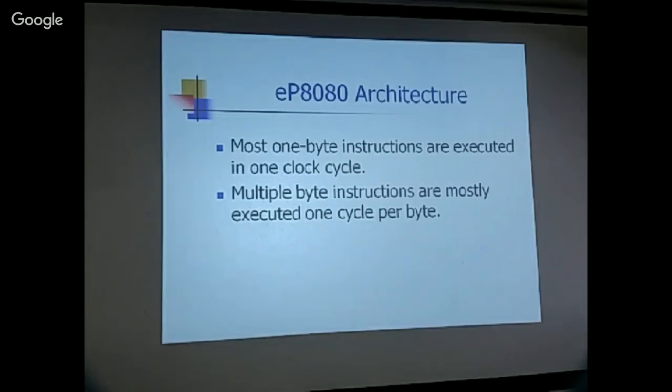Mind you, actually, that's not true for the 8080. It's true for the classic design: to execute one instruction, you need four cycles. First cycle, fetch the instruction. Second cycle, decode the sources. Third cycle, execute it. And fourth cycle, store back. That's the classic clocking scheme. But I think the 8080 came way before this kind of architecture solidified. Remember, these are hardware people. They tried to design calculators, and this is basically the calculator design, carried on into a microprocessor.